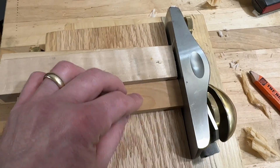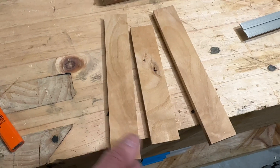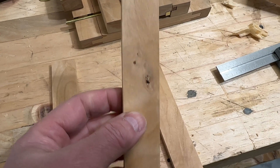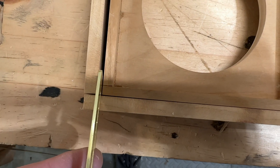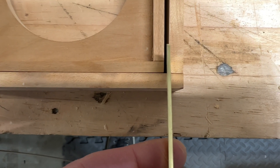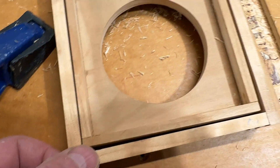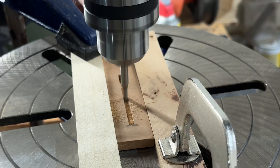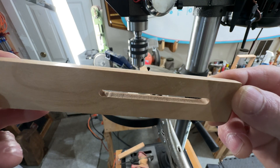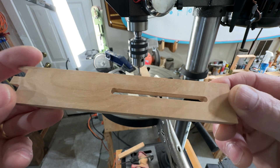What I'm doing here is squaring up these front standard side pieces and the base. I kind of like the eccentricities of this cherry. Ideally, I want to be able to slip essentially an 062 shim on either side. I cut them and I think it sort of worked out the way I wanted it to — just moving it sideways with very, very shallow cuts so I'm not removing very much material. That seemed to work really well.